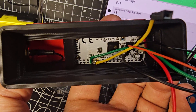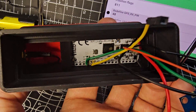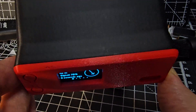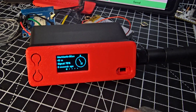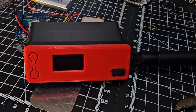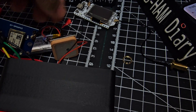The front's all pushed into place. With the wires soldered on the back of the board — the yellow and green wires — just keep them nearer the center of the board, because it goes right against the outer part. When you're pushing the front in, since it's quite precision measured, you don't want that getting in the way. I don't have a switch on my particular battery so I just put a grommet there where the switch would go.